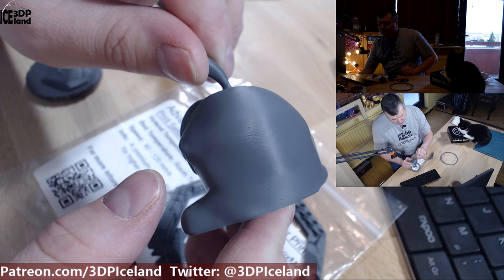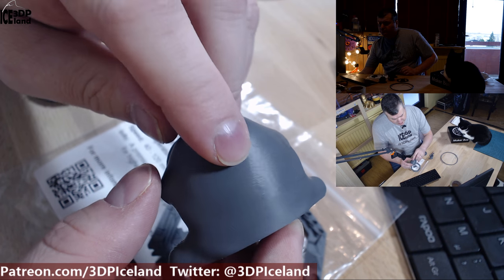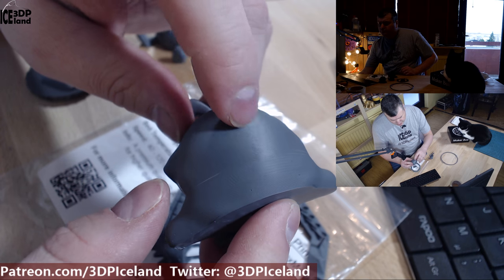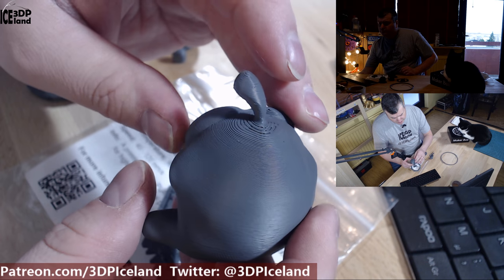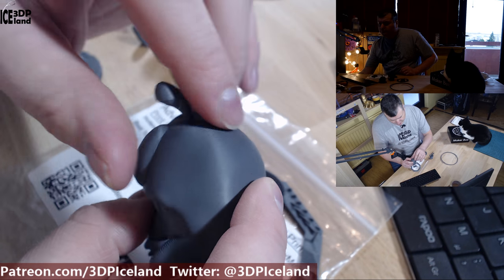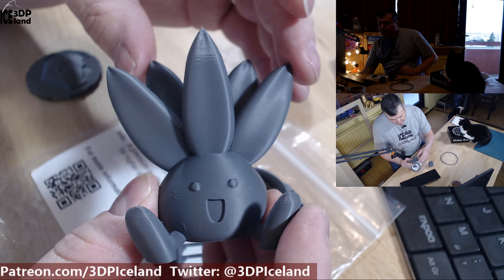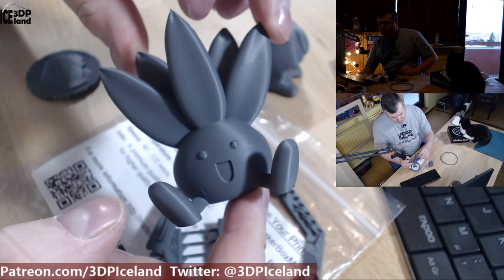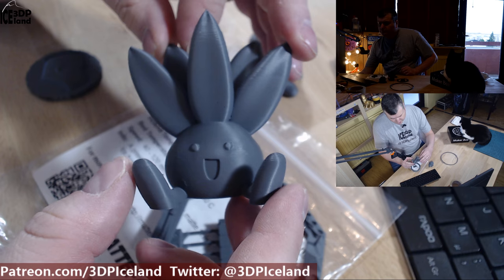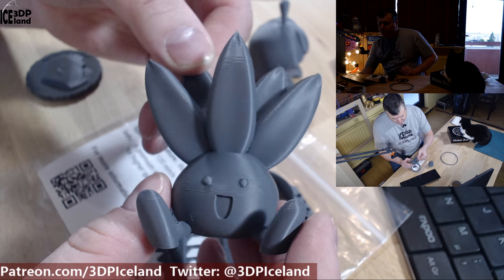As you can see there's very good surface finish and it's difficult to see the layer lines even though this is printed at 0.2 millimeter layer height, so it fuses well together. On the top it's of course different, but on the sides it's very good. I then printed out the Otis model by Garrett at Kaos Cortec, which is an addition to my Megabox test prints, and this is also printed out with zero infill.